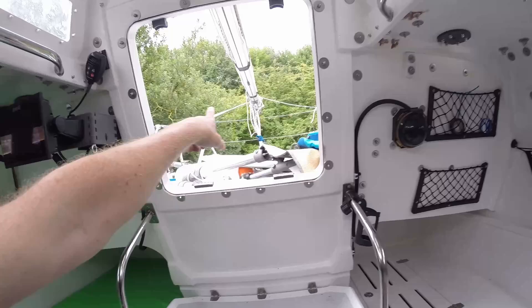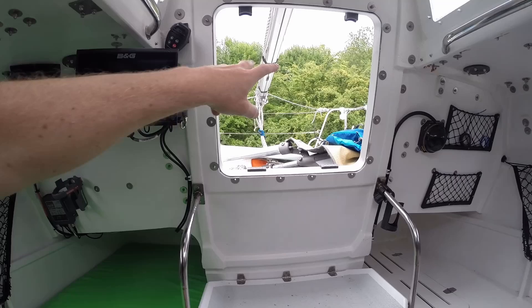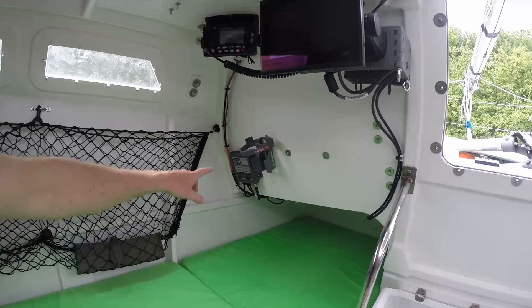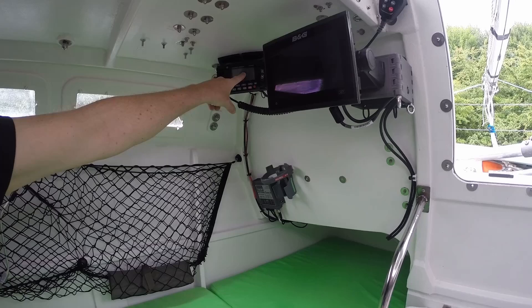The main advantage of this plotter is that you can plug a transducer straight into it, so there's no separate transducer-to-NMEA-converter-to-plotter chain — you don't need a separate unit for that, you can network it all together. It talks to the two GPS antennas on the outside, which talk to the AIS unit, all via a very simple network. It's frighteningly expensive to buy the network cables, but it is worth it. There's a lot of redundancy: the unit has an internal antenna and also an external one that takes in the American GPS, European, and Russian signals.